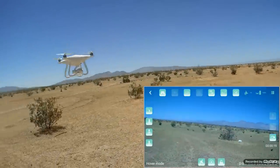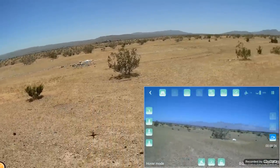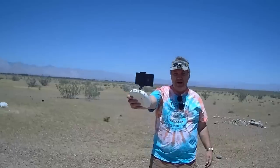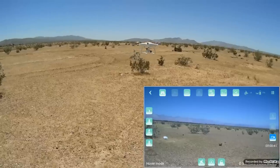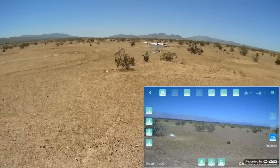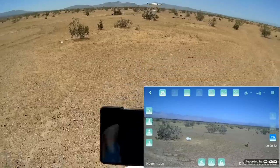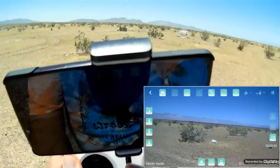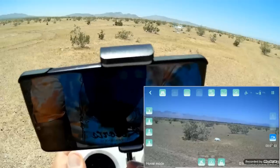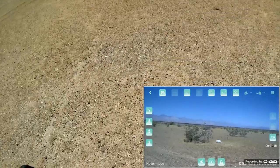Getting the drone into the air and moving it over a bit — pushing forward, turning, adjusting altitude with the sun in my face. Checking its stability: it's on GPS but drifting a little to the left. Checking satellite count — only about seven satellites, so I'm not sure I have sufficient satellites. It drifted about seven to eight meters. Holding position now — we have 14 satellites. Let's come back over.